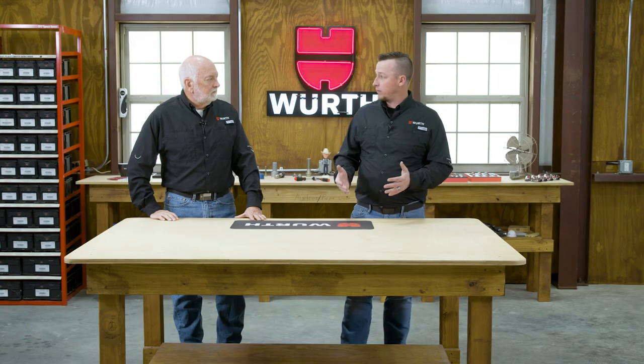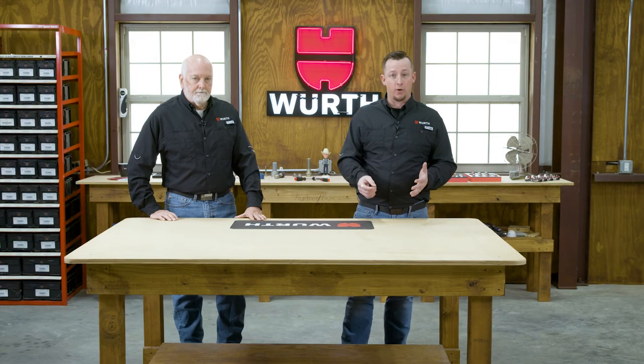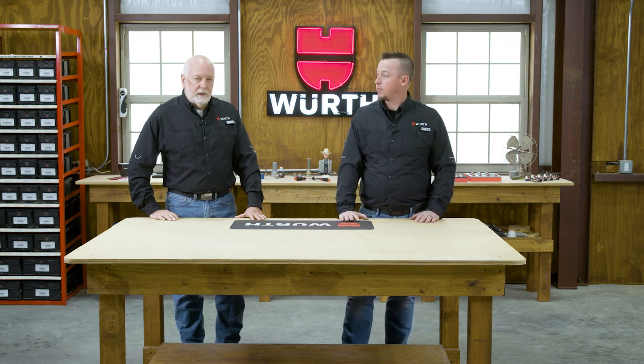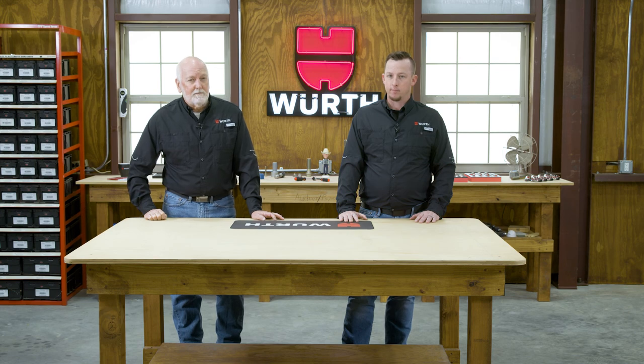So guys, let's use those rivet gauges. That's really important in this. The IFI shows us reference dimensions primarily. And the way we measure is the diameter is by a 32nd, and then the grip lengths are by a 16th. Correct. Use the number system. Assembly is easy and can also be automated, anywhere from single use to thousands of pieces in an automated line. Blind rivets are hopefully a good choice for your assembly. Fast, permanent, one-side assembly with blind rivets.